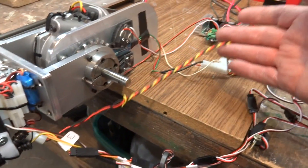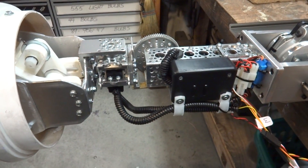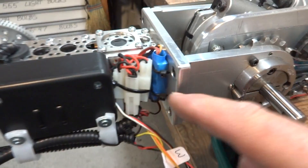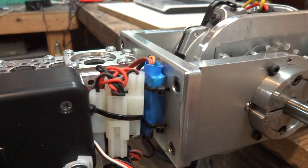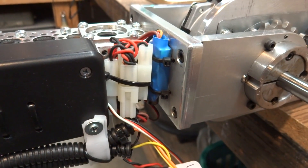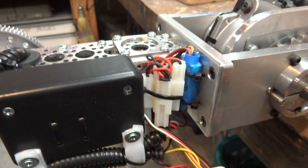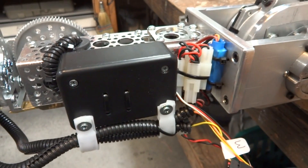Right now I've got 12 volts going in here from the power supply. But my servos only take 7.4 and 6 volts. So I've got two separate step-down voltage regulators and they're really cool. Here's one right here — it'll handle up to 10 amps. It's a little switching power converter that will take anywhere from 5 to 24 volts and knock it down to anywhere from 4 to 9 volts depending on where you set it with software. It's really nice, it's lightweight, and it doesn't heat up.